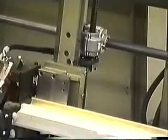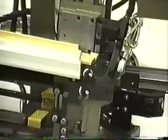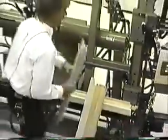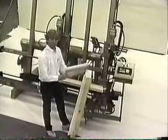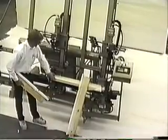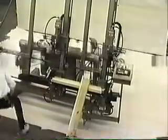I've got a series of stops here — we're at 90 degrees. On the sill side, we've got an adjustable arm here; it's actually at the sill angle. We custom make that. Everything's custom made. The clamps that actually come in — in this case, this particular customer ordered brick mold. He's got brick mold going around it, so we specially configured some clamps to come in and grab both pieces. Now it's grabbing both pieces in all four corners. I'll get a chance to see that here in just a second.